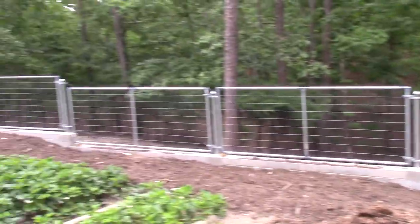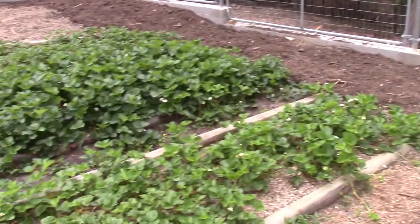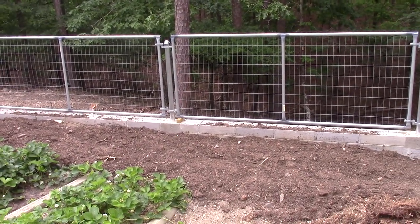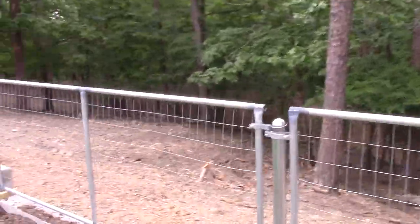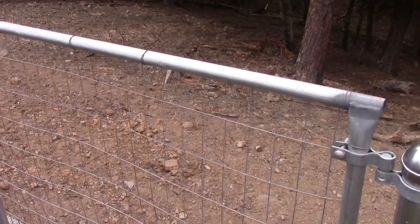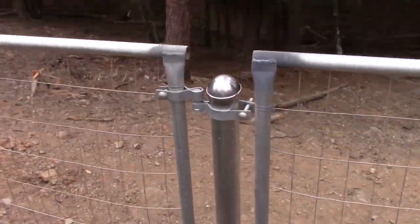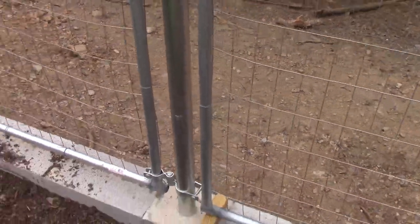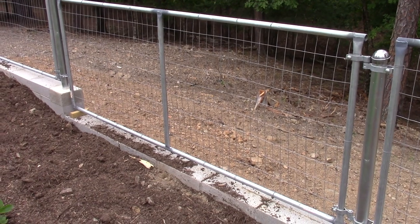Here are my finished gates — they're on the back side of my garden. The reason I didn't just put a fence up across here is my strawberries. The bad thing about strawberries is they grow right on the ground, so this retaining wall lets us stand on the back side, open the gates, and reach through to pick the strawberries without having to bend over. Here they are finished — I sprayed a little bit of cold galvanizing on there like spray paint, and attached some 2x4 welded wire with galvanized wire. Then hung them with chain link fence hinges, and the posts are made out of galvanized conduit — cheaper than what they sell for chain link fences. That's my finished gates. Hope you enjoyed the video — thanks for watching.